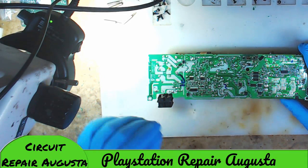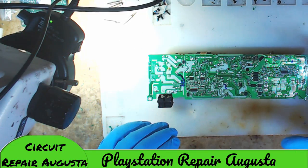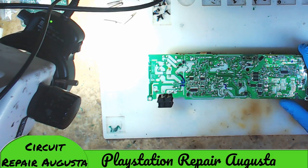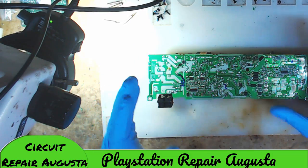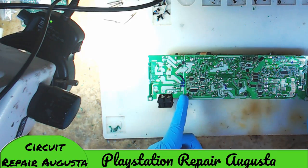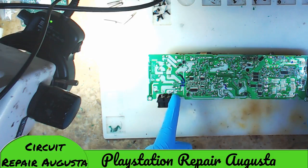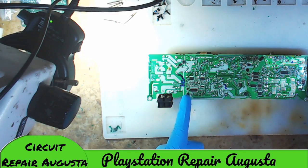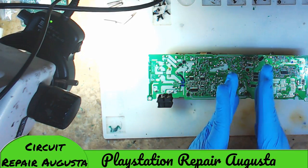Let's get back to the topic. This is our mains side — we've got 120 volts AC. There are a lot of different power supply models; pretty much every console iteration from SAA to SAE has different power supplies. They work the same but components and configuration will differ. What stays true is this general format: mains 120 volts resides in this section, then there's a dividing line. Just because current transfers over doesn't mean the danger ends — there are still voltages on this side that are able to take your life.